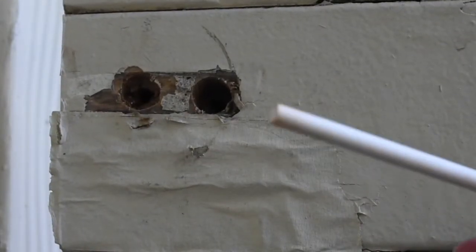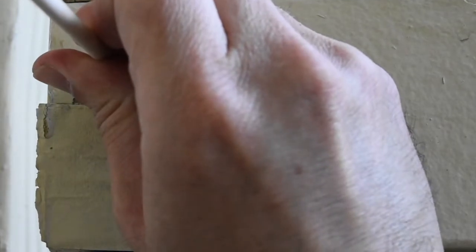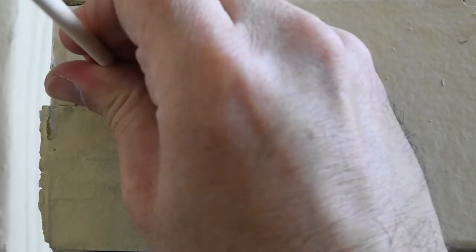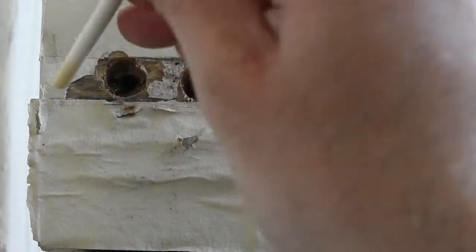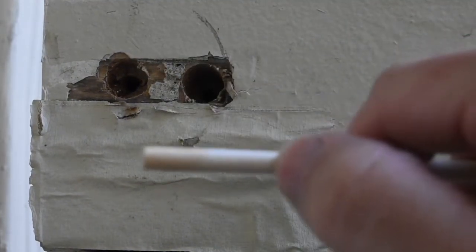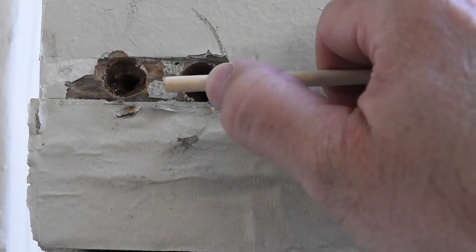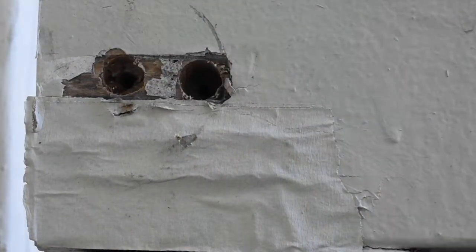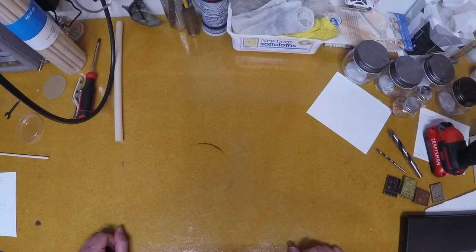All right guys, so here's our little dowel that we're going to use for the small hole where that screw is in the way. We're just going to put this in here, get it in all the way and get a nice tight fit, and then we'll use a bigger dowel for the rest of it. So let's pull this back out, and we can see right there the discoloration on the dowel. That's where we're going to cut it, so that we can fit it in just that little tiny hole in the middle of our big hole. So let's get going with that.